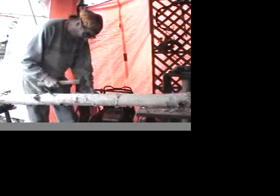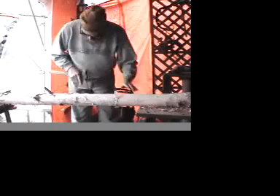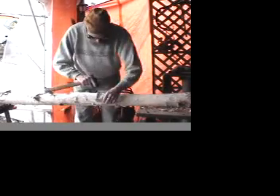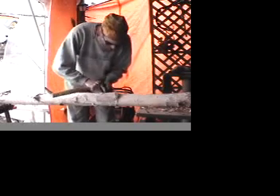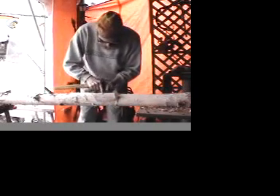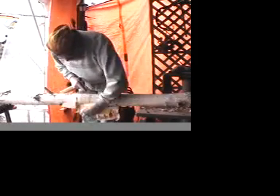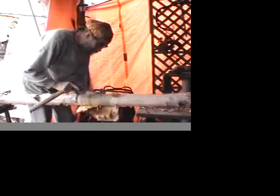In theory, these cuts are all lining up and making one long straight line. Once you've got that scored down the full length of the log, with the axe fairly sharp, I can get in here and start peeling the bark away. You can see I can cut it and start peeling away, pulling it off in these long slices. I'm kind of wedging and scooping with the side of the axe.